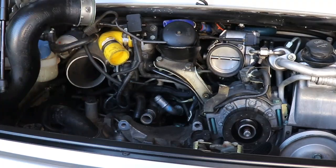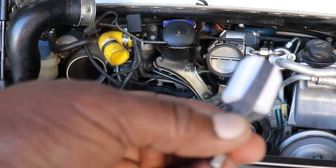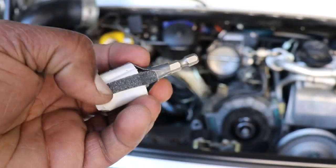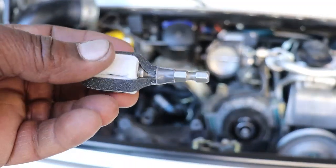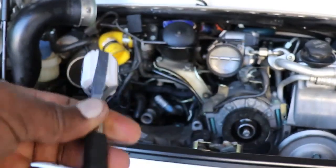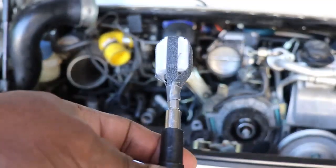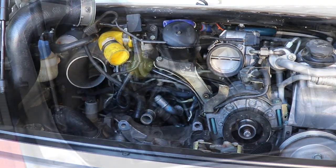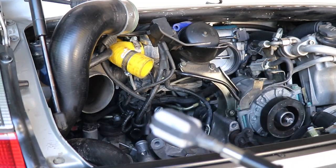So I'll let you see this in advance, so when I do it, you know what you're looking at. All right, I went ahead and put the skateboard grip tape on the little marshmallow here, and a little bit of T-Rex tape to hold it so we know it won't let go. And our housing hone, we'll call it, is ready for service. Put it on the flexible extension and away we go. Put it in, apply a little bit of pressure, and we'll rough up those edges so our adhesive has something to hang on to. Not sure how much of this you're going to be able to see, but I'll let you watch. We're going to go ahead and do our hone now.